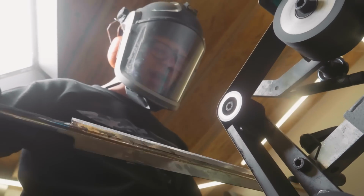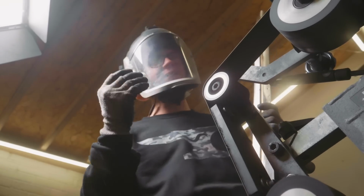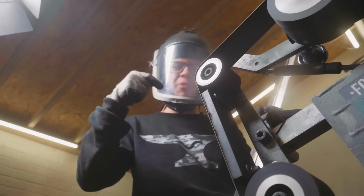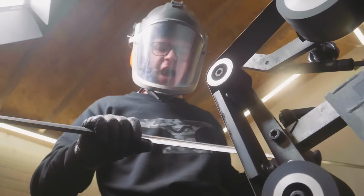Though the blade has been tempered, it's extremely hard. And though we're using ceramic abrasives, they really don't like to cut, especially if there's not enough pounds per square inch of pressure on it. It wants to cut only if there's a tiny bit of steel that it's cutting at a time, or you've got extraordinary pressure. You can see here, I've got now two chamfers there.